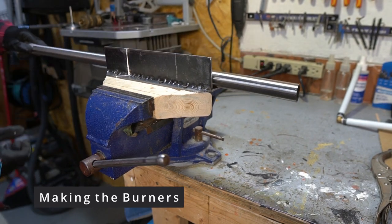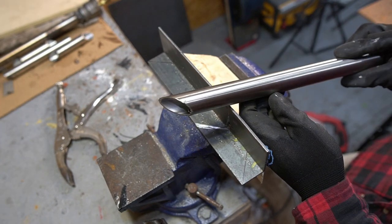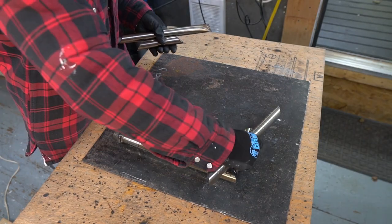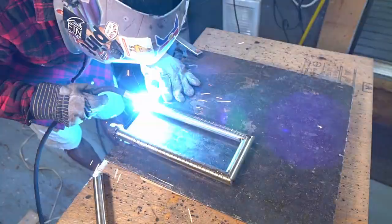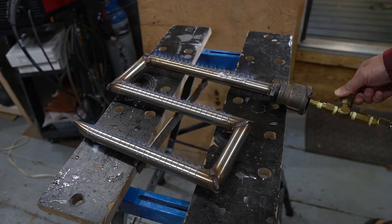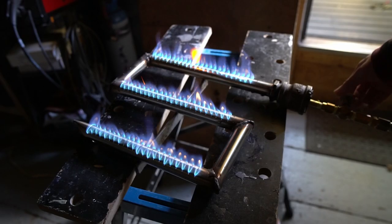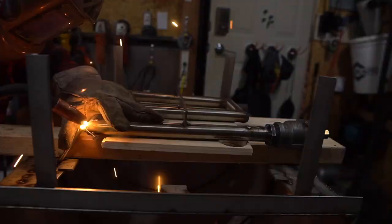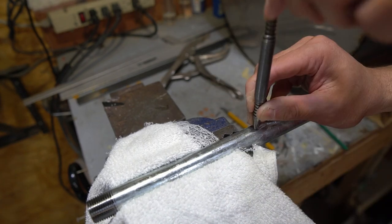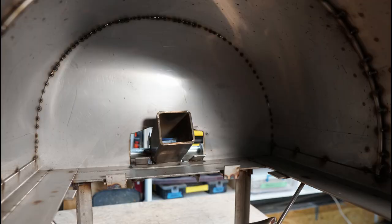I have a few videos on my channel on how to make the burner so I won't go into super detail here. Here I'm miter cutting some one inch stainless steel tube for the bottom stone burner. I cut slits into the tubes with my band saw, then I weld up an S-shaped burner from the tubes. For the orifice I used a 1/16th of an inch hole — I'll post a link in the description with more details on how to make this burner. This here is a half inch pipe nipple — I'm flattening a spot to drill an orifice. You can see here how it's mounted in the rear of the oven on an angle.